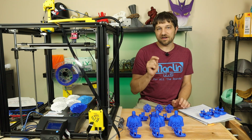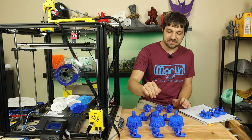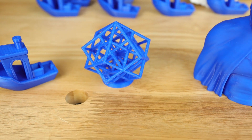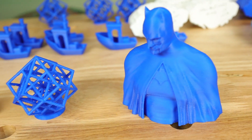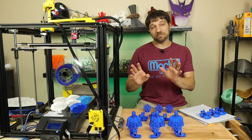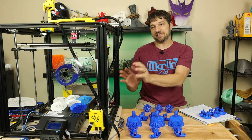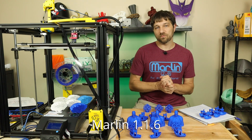A lot of people like to run their machines at higher speeds, so I also did the same benchmarks at 100 millimeters per second. The 100mm/s results were kind of what I expected — they don't look as good as the 50mm/s prints, but they're not bad. They just have some trouble areas. Once all of these were done, it was time to install the Mini E3 and test that board first.